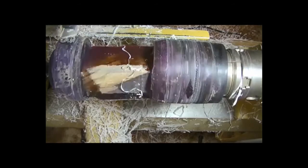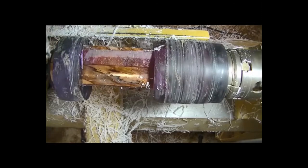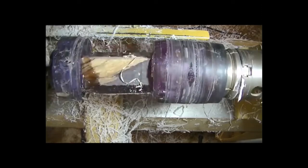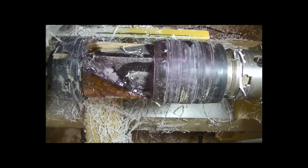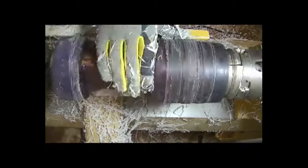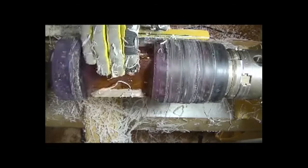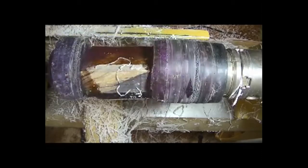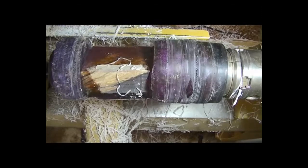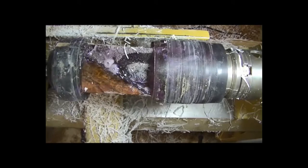You can see I have some chips that went flying here. The carbides are really, really sharp. You cannot push hard. But I wasn't too worried about that because this is not going to be the end shape right here. Also, resin, you can get air bubbles, and that will happen as well. They'll come flying off where there was an air bubble if it cured too quickly in that region. I think my tenon is just about there, and then I'll be ready to turn it around.